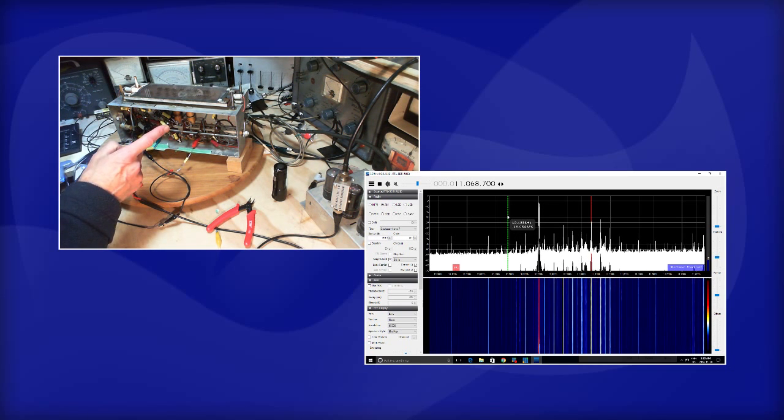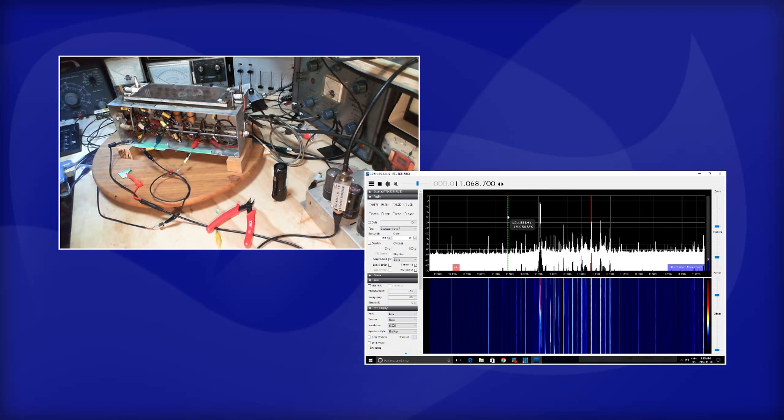Then, that being done right, I think the 10.7 signal we're looking at should be right where it is now. But for now, for all I know, I'm not feeding in 100, I'm feeding in 100.01 or something. The IF is mistuned somewhere else. And yeah, I can combine those things to get the 10.7 to show up where it is, but it's not necessarily correct. But you see, I'm not feeding in a 10.7 signal into this radio. I'm feeding in a 100 megahertz signal into the antenna and trying to fix things so that I know for sure a 10.7 signal is being presented to the IF. Correctly. Put that last word in correctly.